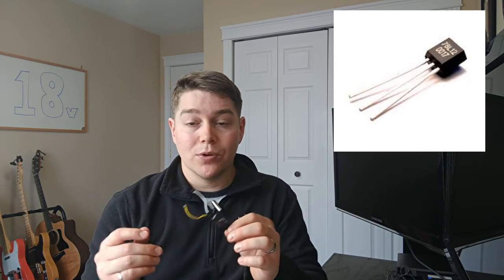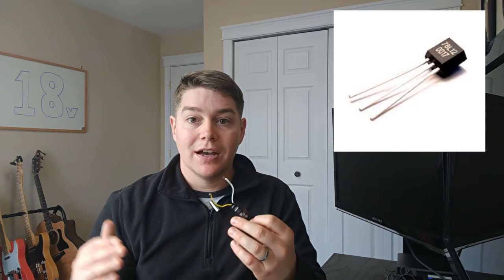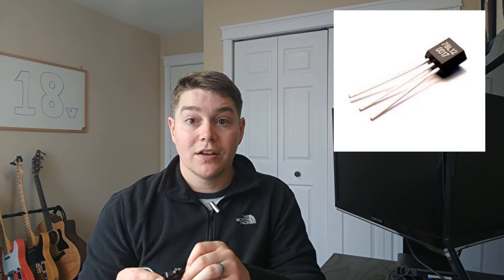Also something that is quick to touch on, sometimes you don't need 18 volts, you need 12 volts or 16 volts or something along that line. By just adding another row or column, depending on how I have this oriented to the diagram that was seen in tagboard effects, you can put a little voltage regulator in there, those TO92 type chips, and buck that 18 volt output down to 12, 16, whatever you need that's in that area between 9 volts and 18 volts.